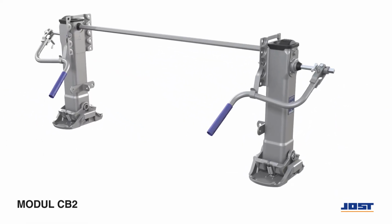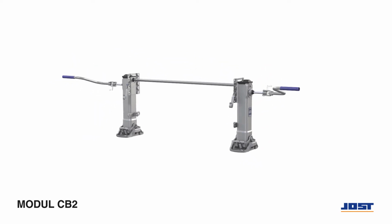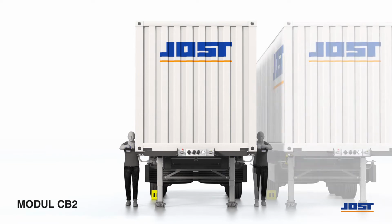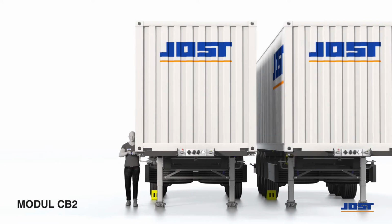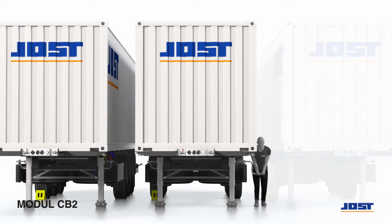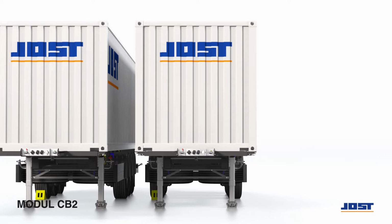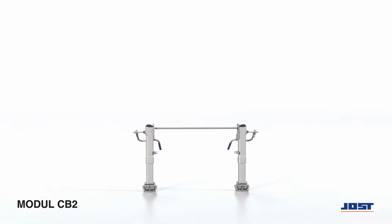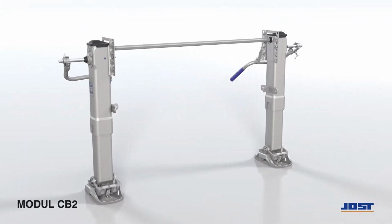Module Cb2 Landing Gear is designed for two-sided operation. The special crank handle supports simultaneous two-sided operation in the same gear, or one-sided operation on the left or right. After operation, the crank handles have to be hooked back into their supports. Two-sided operation can also be utilized with other Model C variants by using the special crank handle.